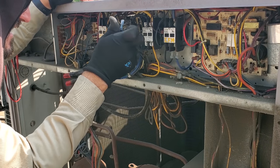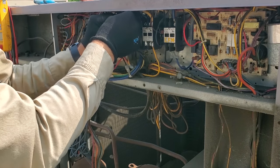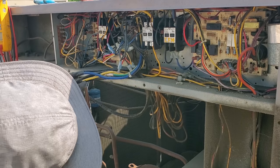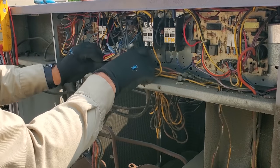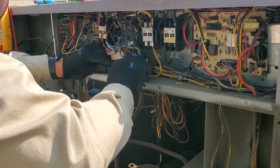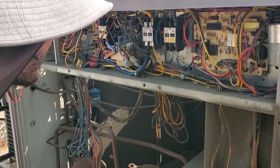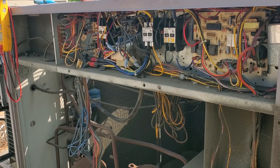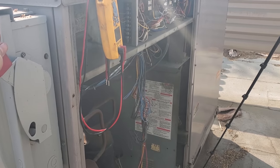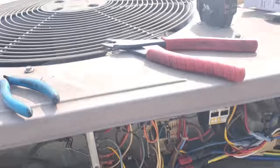This guy goes on this connector right here. I will clean all these wires up — I just want to see if this stuff works. Put that back. Everything's safe, everything's out of the way. We're going to turn it on and see if anything blows up, standing back out of the way. Compressors turn on — one's running, two's running. This condenser fan motor's not running, but both compressors are running.